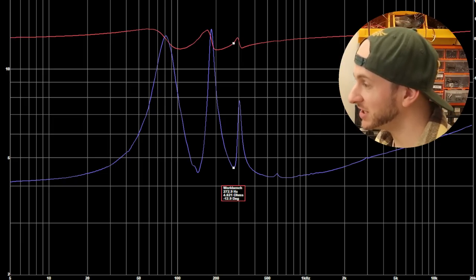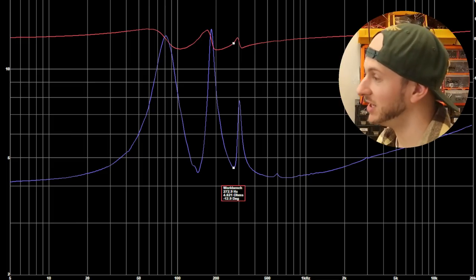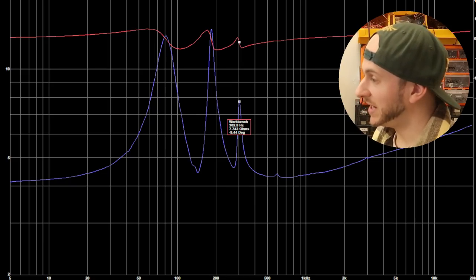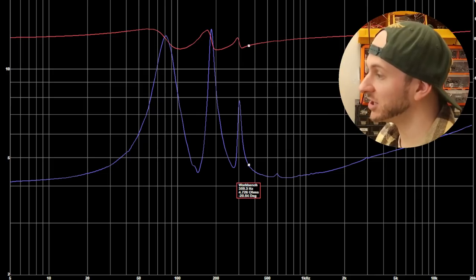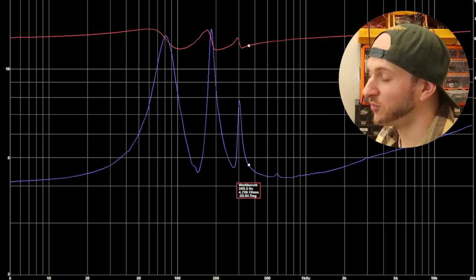So yeah, we've got two frequencies that are pretty loaded on this thing, which is pretty crazy. After that we rise sharply to what is probably the air spring of the first chamber, which is up at about 300 hertz. The last frequency we play, which is a 360, is all the way up here right down at the bottom of that third impedance spike. So that's not at any kind of port loading mode, that's not at any air spring.